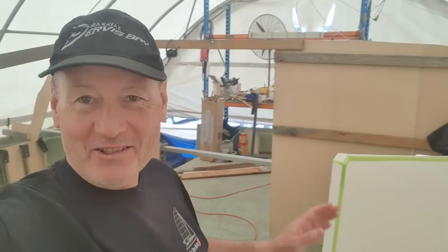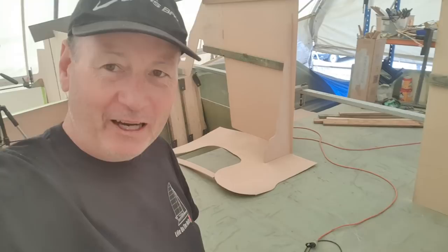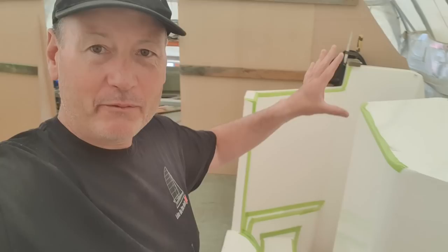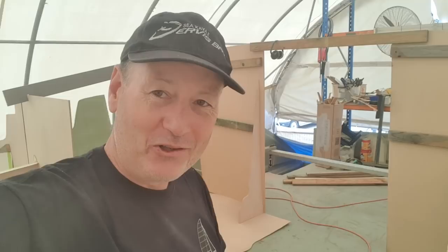I've been in a bit of a templating frame of mind lately, and doing this back wall has given me so much more foresight into the way the layout's going to be inside the saloon. I've taken a template off the galley mold. The reason I've done that is to work out exactly where all the internal partitions are — this back wall has allowed me to work out where it intersects with the outside wall and get an exact measurement of the width of the deck mold. Lots of work, but templating reaffirms everything in your mind before you go headlong into chopping up glass and making foam sheet.